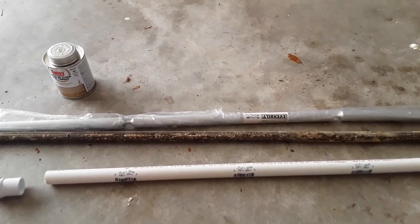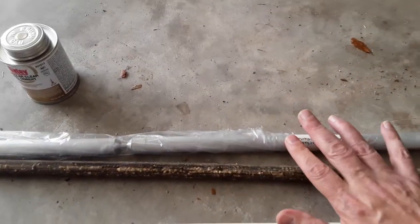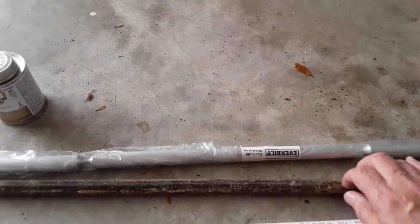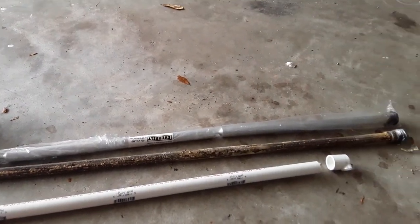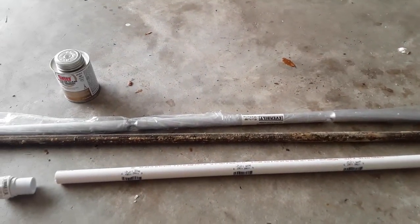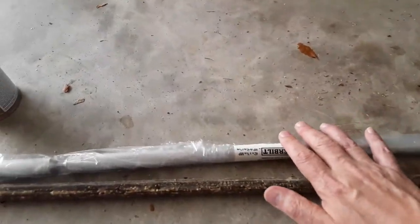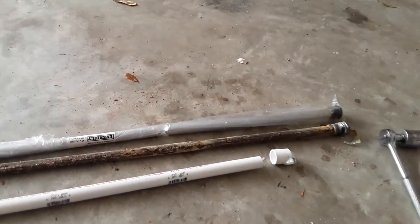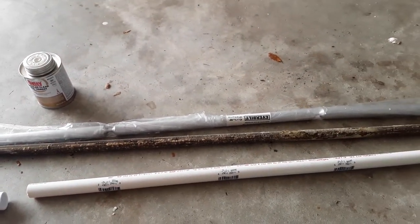Let it really work into the water and clean out any bacteria in there. Now, the original anode is magnesium, but this new one is aluminum. I read that aluminum anodes are better for hard water and take care of corrosion a lot better. So I'm using the aluminum one — it's the only choice I had. You can see the breaks in it so you can bend it if you have no room, but I have plenty of room. I really didn't want this kind, but it's all they had at Home Depot unless you go online.